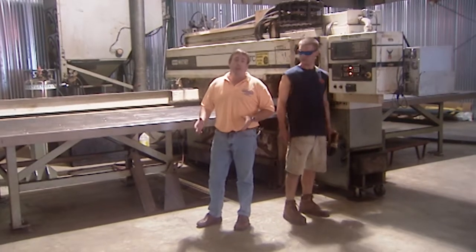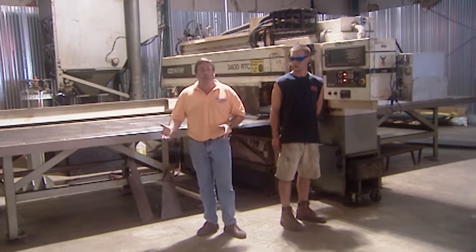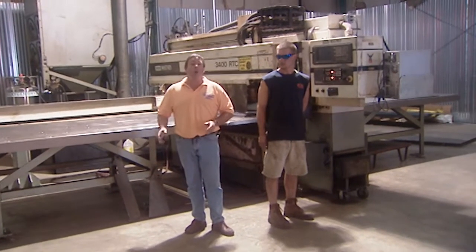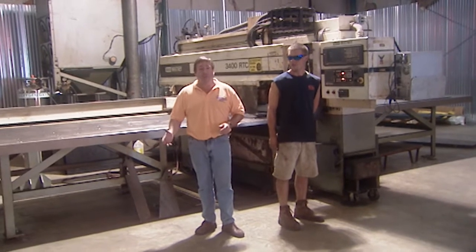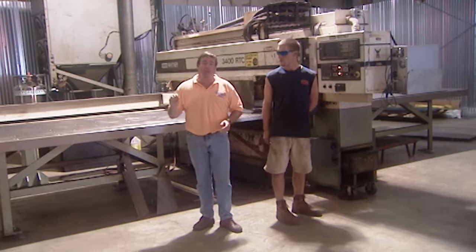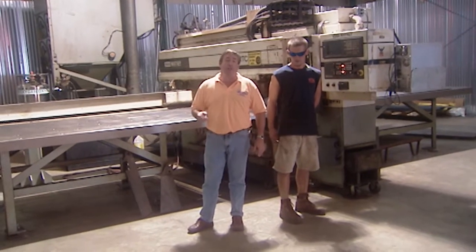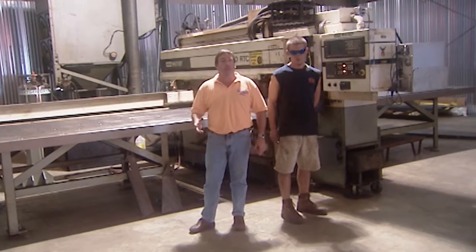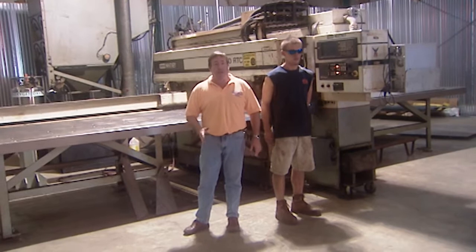But because we're going to start building a Ted Brakes lawnmower, because I have the patent on front brakes for zero-turn lawnmowers, we're going to switch to a Cincinnati CL800 laser, which will cut up to 1 inch and cut really, really small stuff really fast. This machine will cut half-inch plate at 110 inches a minute, or down to 11 gauge at 300 inches a minute.